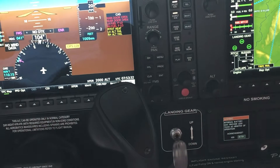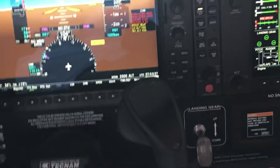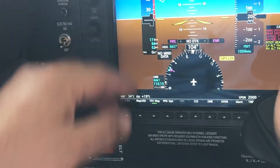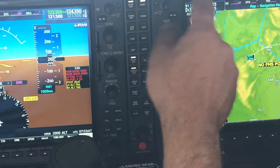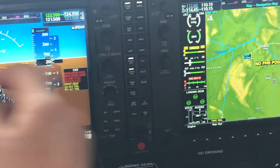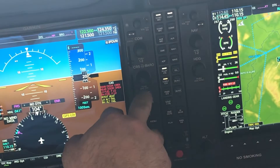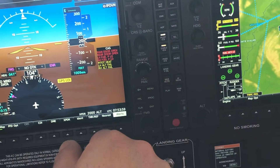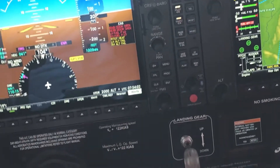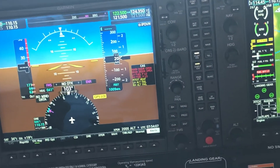This is how to enter the NAV frequency. You see now — you just move this knob and it enters the NAV frequency. Here is COM — NAV and COM. Here is squelch setting — you just press auto settings. This one is a backup battery for emergency use.